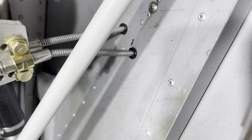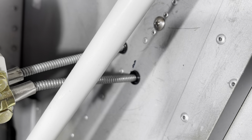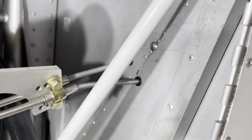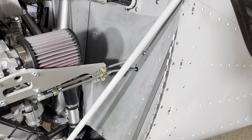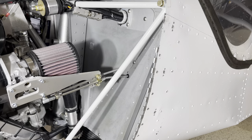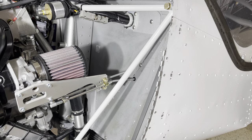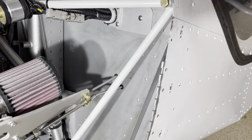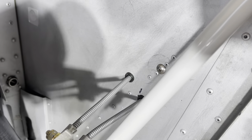You can use little plastic or nylon grommets — split them quarter inch, drill a hole for it, pop it around the cable, and push it through. It does have to be a split design. They also make fancy ones; the eyeball type just costs a lot of money for nothing in my opinion, but they do make fancy pass-throughs for throttle cables.